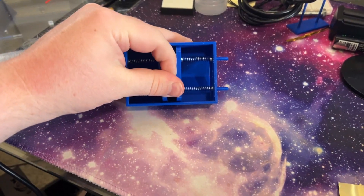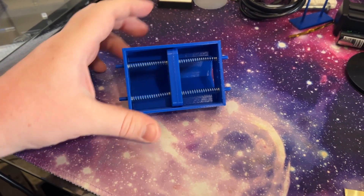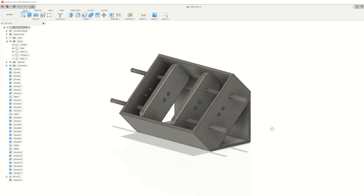Initially I created a small enclosure with springs to help keep everything in the voltaic pile nice, close together, and centered. However, I ended up abandoning this idea because it crunched everything together. The tissues would spill over the edge of the metals when wet, causing contact between cells which lowered the voltage — essentially a short between different cells. In the spring-loaded pile I was only getting about 2 to 3 volts, but with 10 cells at 0.7 to 0.9 volts each, I should have expected 7 to 9 volts. So the springs were kind of cool but a headache, and I ended up abandoning them in favor of a gravity-fed version.